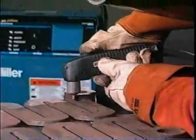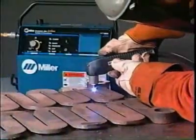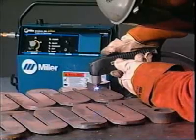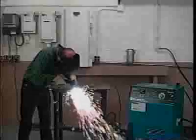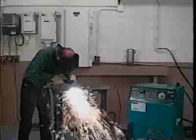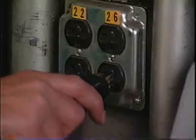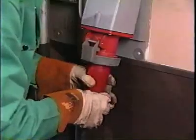Here's the equipment you'll need for air plasma cutting. First, a power source designed for plasma cutting. Typical models range from 12-amp systems that will sever quarter-inch mild steel to heavy-duty industrial models with 100-amp and greater output and the ability to cut inch-and-a-quarter material. Input power requirements will vary from a simple household wall outlet to three-phase AC power.